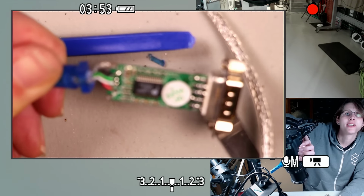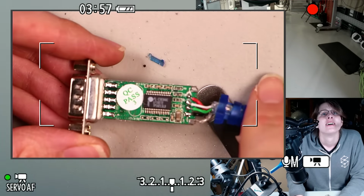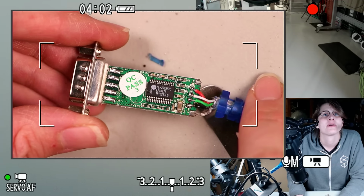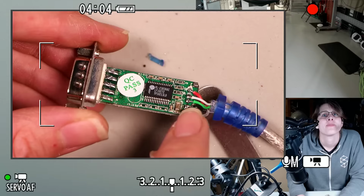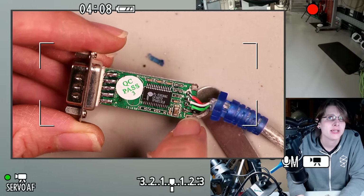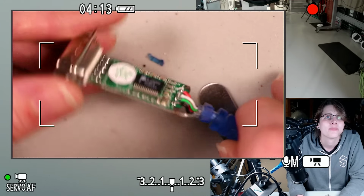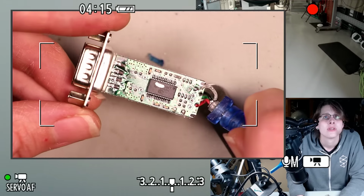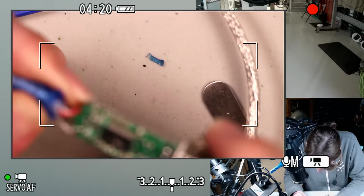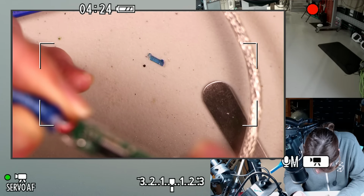Oh, I was waiting for it to autofocus, but it's not on autofocus. Okay. So there's the actual PL2303 chip. That was the footprint. It looked like it might also be suitable for a USB Type A connector, so that's interesting. Then I assume that would be the line driver. What line driver is that? ZT213.